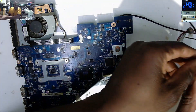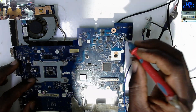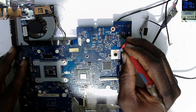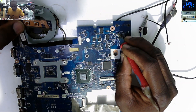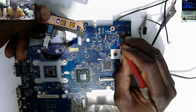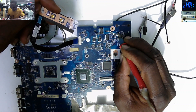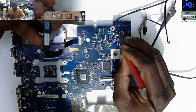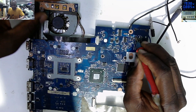So what I'll do - I'll disconnect the plus here and come with 19 volts directly on the current sensor to see how much current the board is taking. It's taking 19 volts - and our board just started! You see the light? That's crazy. Our motherboard is now working and it's still on. The PCH is getting warm and you can see the light.